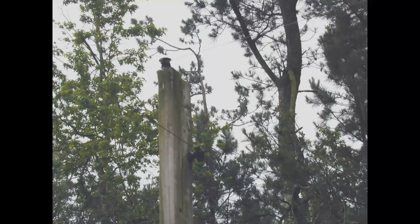Now, in some cases where you have a real long span and the wind's blowing sideways on it, you may want to use something a little bit more rigid. And so occasionally you can use a post that's made out of pressure-treated 2x4. To keep it from warping, what I do is I make a T-post out of it. I'll nail the edge of one 2x4 to the face of another 2x4. And, of course, if you look at it endwise, it looks just like a T.